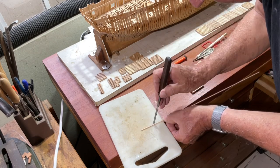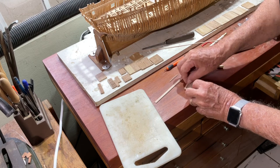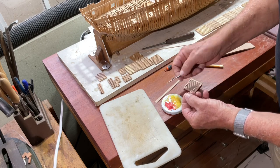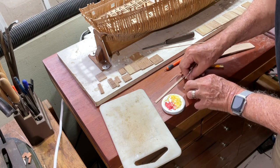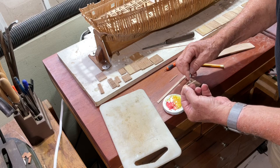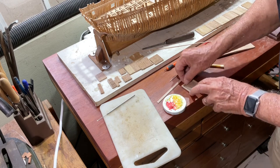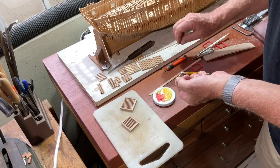On the lower deck gratings, we stuck everything in. I've decided that these are going to be able to move in and out. So it was a simple process of cutting pieces to fit, using PVA to put them in place. Stick them flat so that they're sitting down flat — in my case, on the bench. Leave the PVA to set for about 10 to 15 minutes, so that they'll attach to the inner side of the frame, and then push the gratings out.